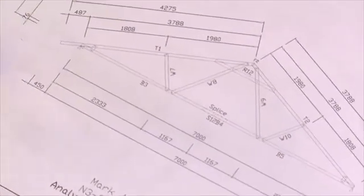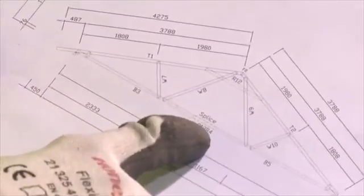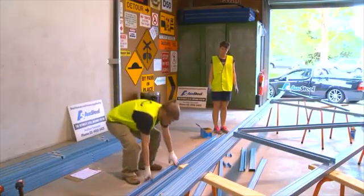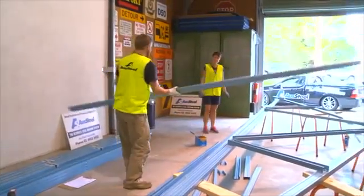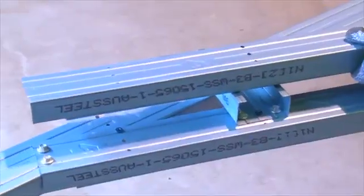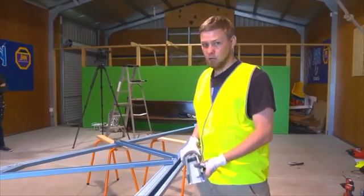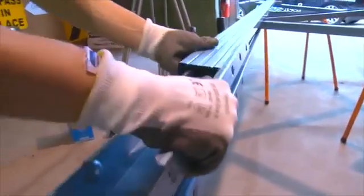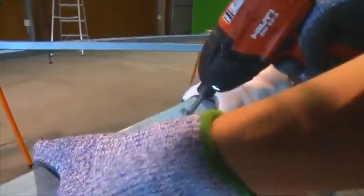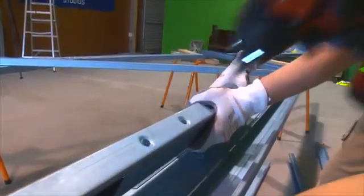This particular truss is our back-to-back truss. You'll build it from the flat side up with B3 and B4 to start with. With B3, make sure the label is on the left hand end. When joining your bottom cords together you'll use B4, and they will box together only one way.